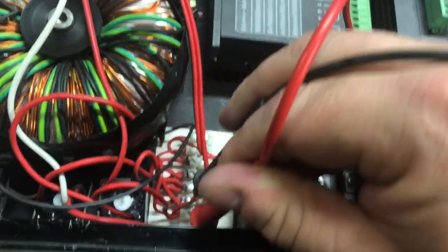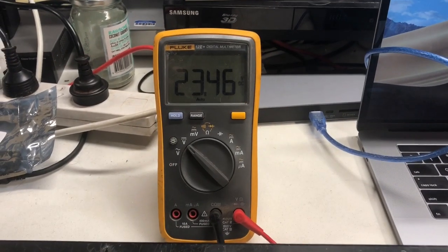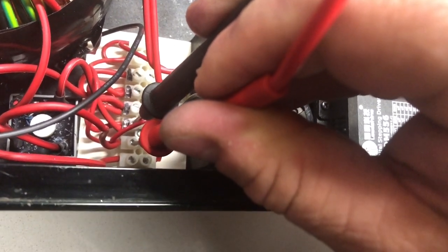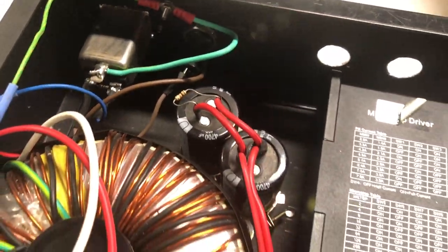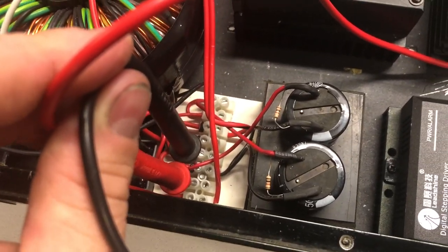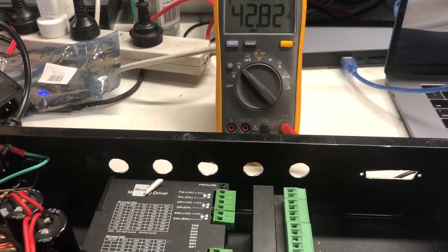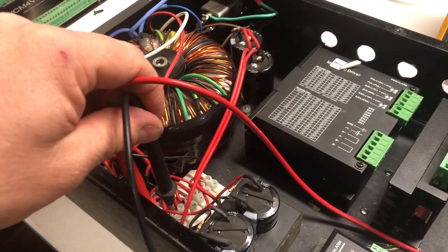On this tap we've got 64.8 volts, and on the one alongside we've got 23.4 volts. So we've got 24 volts and 65 volts - quite a big, chunky power supply. And once the power comes off, we've got these little power drain resistors that just slowly discharge the caps. So there's still 17 volts in the caps at the minute, and 43 in the other caps. So we don't want those to be touched until they're drained. That's a nice little safety feature that Paul's put in this.